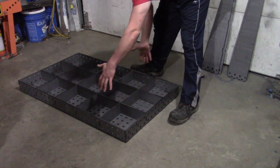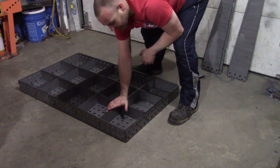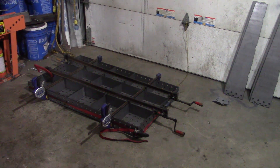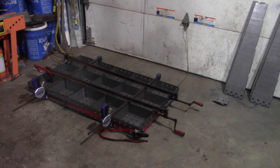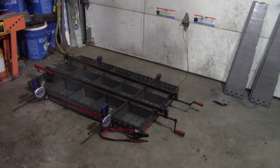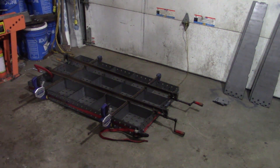Now what we're going to do is put clamps all over this and make sure that it's all pulled right together nice and tight. We're going to start pressing them together from the top down, and that's going to make sure that our top is nice and flat and everything here is square. We have it roughly assembled right now. I have a red ratchet strap going all the way around, and I ratchet that in to pull the four sides in closer together. I have clamps running in each direction. I'm going to put two more clamps here to pull the middle in. Put a ratchet strap on, pull it around, couple clamps and you're done. The clamps that run the full length weren't long enough, so I used them to jump over to a smaller clamp — a red one and a little silver one — and that gives me the total length needed to clamp in and make sure those are butted up nice and tight against the laser cut.